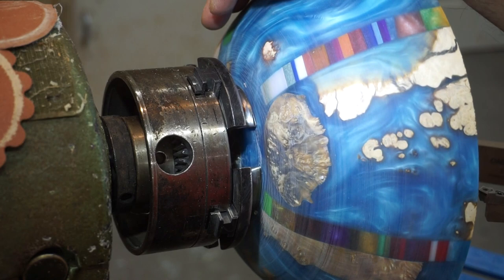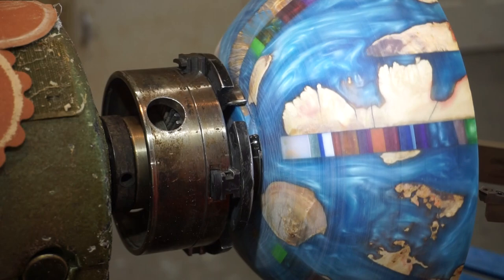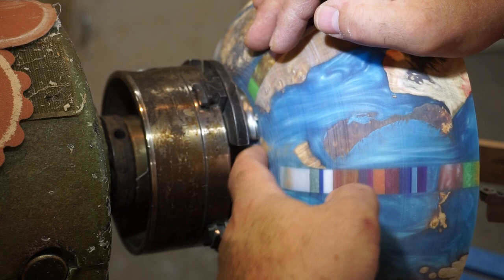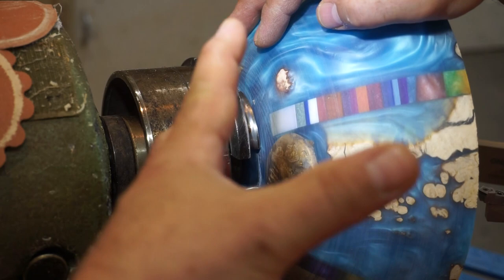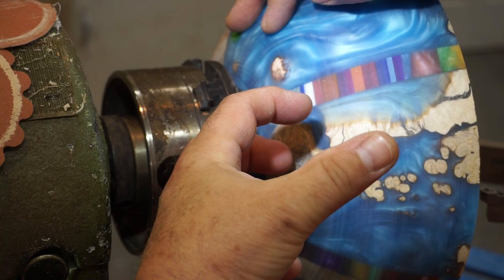Before we move on to coring, I just want to talk about tenons and mortises. I watched Ken Moon from Moon Pie Creation this morning. I have no idea if Ken watches my channel or not, but he was using the expanded mortise, so the jaws were inside the bowl and expanded, and he ended up cracking the bottom of the bowl, and he ended up going through the base of the bowl as well. I moved away from mortises a long time ago just for those reasons. And the other reason is a tenon has greater clamping pressure, so you're less likely to lose a bowl out of the chuck on a tenon than you are with an expanded mortise.